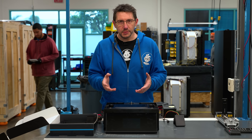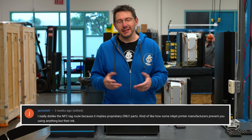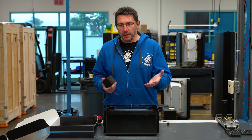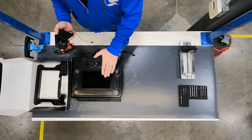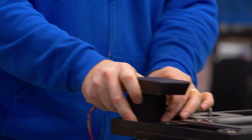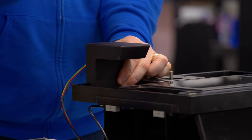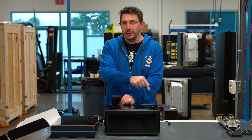The next question I'm going to address is NFC. It's really important for what Nexa 3D is trying to do with the Zip and how it integrates into industrial environments. With any resin machine, it's really good to be able to sense the level of the resin because you have a resin canister loaded. This is an ultrasonic sensor that sits in the back and will keep the resin level known so that if it ever has to add more from the container with the NFC, it can.